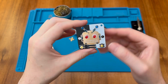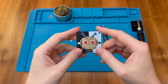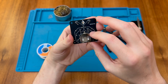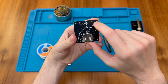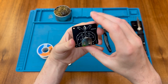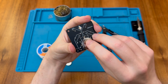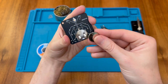So while that was a quick little kit, I hope you found it interesting. I think it's a really fun little project and something to get started with. If you are beginning with this kit, it's worth knowing that when installing the LEDs, the shorter leg goes down towards the battery holder for the centre two LEDs, and upwards toward the top for the antenna LEDs. You can work that out by tracing the silkscreen lines on the PCB, which trace the negative back to the pad on the button cell holder. There's also a plus sign showing that the positive side of the battery should go upwards.